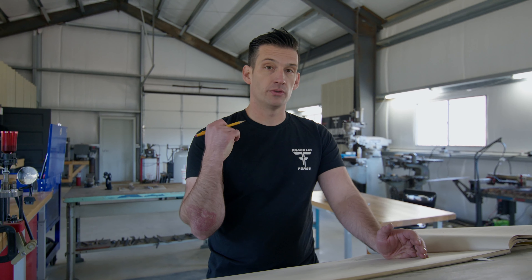Tip number three is stance. What we see in our knife making classes is improper stance. For a novice knife maker, stance is everything — it helps the steel move faster and prevents back injuries. If you look at Brandon, he's standing very far from the anvil and can't get a good swing. Stepping up closer to the anvil and locking the tongs into the side of your leg — of course it's human nature to stay away from hot metal, but locking your arm into your leg with a good grip on your tongs will allow you to hammer on the steel without it moving back and forth.